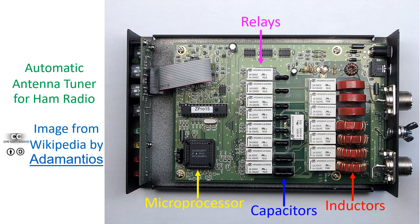As the automatic antenna tuner starts tuning, you can see the needle in the SWR meter coming down until an optimum SWR is reached, ideally 1 to 1. If the SWR is high, modern radios will cut down power to protect the final stages from heating up and prevent adequate power delivery to the antenna.